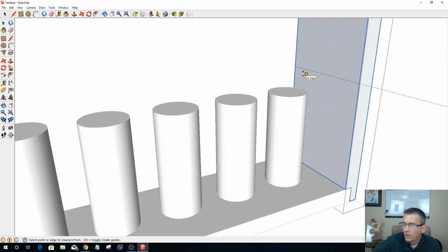No. Across the grain is a dado. Groove is with the grain. Unless I want to put a shallow groove for the shelf to butt into on the back, then I think my shelves are just going to slide in and butt up to this, and then I'll just pin nail it from behind or something. I'm not going to get too carried away with it.